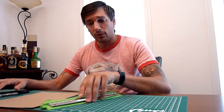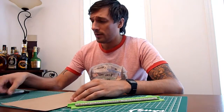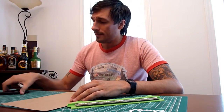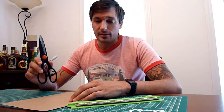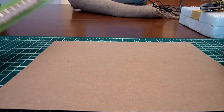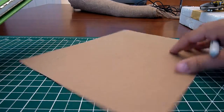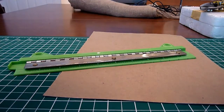Assuming you're going to be making more than one snow stake, you want to make a template. It's going to be a little easier to trace out on the titanium and maximize the use of your material so you don't have too much scrap remaining. A ruler, piece of cardboard or bristol board, a Sharpie, and a pair of scissors is all you need. The snow stakes actually measure 3.5 inches wide and 5.5 inches long, so the first thing we're going to do is make a rectangle.